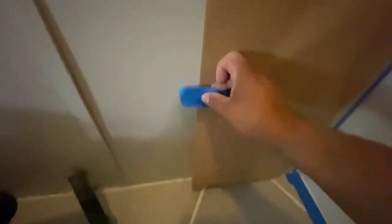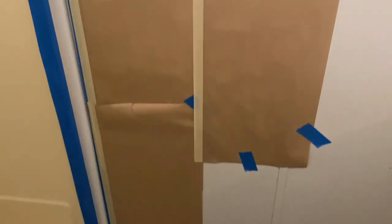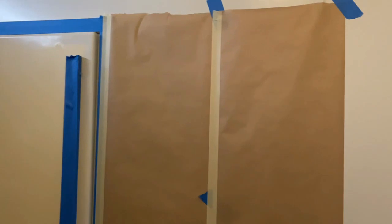On any painted or freshly painted surface I'm going to be using the blue painter's tape. With the masking paper I do use masking tape because that lays right on the blue tape around the perimeter. I don't like to just use masking tape because it doesn't give me as clean of a line when I'm done. This is the way I do it.